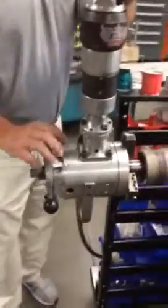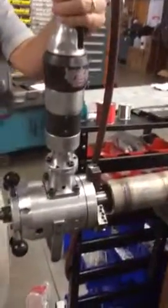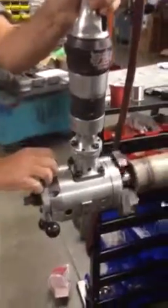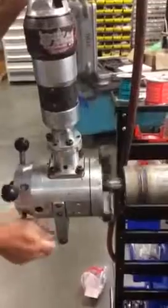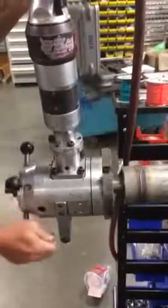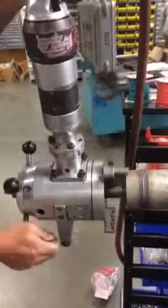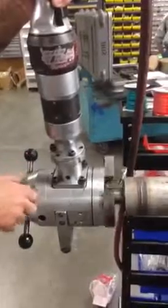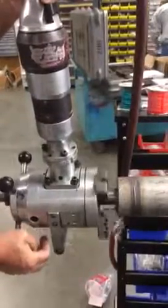What that'll do is make it rigid to the shaft, so when you machine it's not going to wobble or jerk the machine on the shaft. Basically all you do is hook your air to it. You see the spindle spinning slowly — that's pushing the bit towards the pipe. Just keep pushing on it and it'll bevel your pipe.